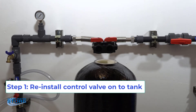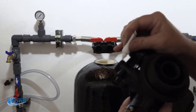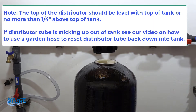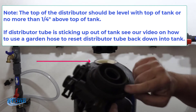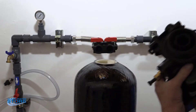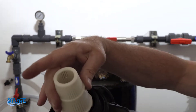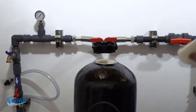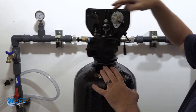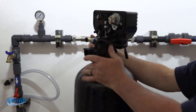Now we're going to go ahead and reinstall the control valve. You have two O-rings here and here, and also your two that attach to your bypass valve. What you want to do is take a little lube and put it on there, make sure those get coated so the next time you ever need to remove it again for service, hopefully it will come off smooth. Just put a nice thin film of that around there. If you have a Pro-Aux or ChemSorb, you're going to have a top filter that snaps in there — in this case we don't have it, but in some cases you will. Go ahead and get that D-tube seated and thread this on — hand tight. You want to get the O-ring sealed, but you don't want to crack the valve body and you don't want to crack the tank. So just give it a good tightening.